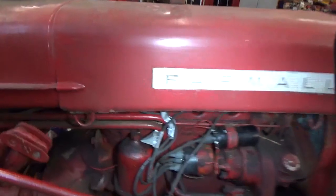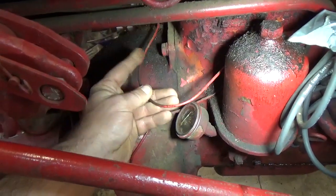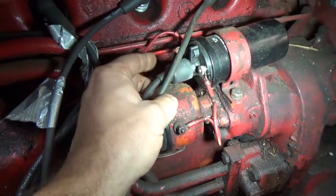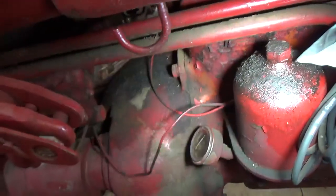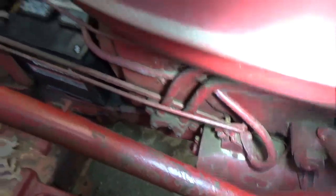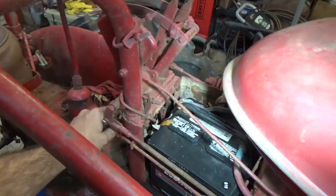The sheet metal on this tractor is excellent. A lot of these, the hoods are usually strapped up — you'll see the hooks are knocked off, broken off, missing, bent, crooked. You can see where they pretty much ran this thing into a full loop right there. They've got the ignition wire and the charge wire running off the same terminal on the ignition coil, and the ignition coil is actually wired in reverse polarity. Running at 12 volt, it should be the other way around.